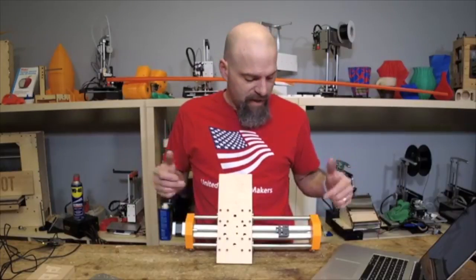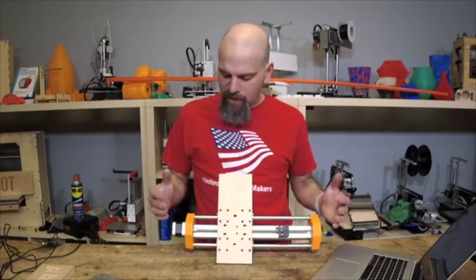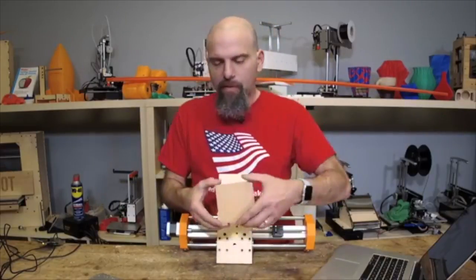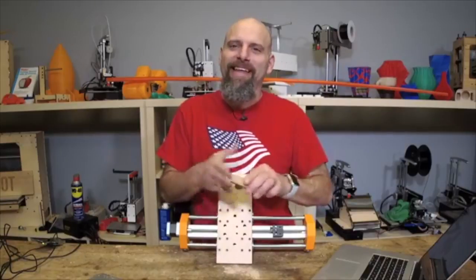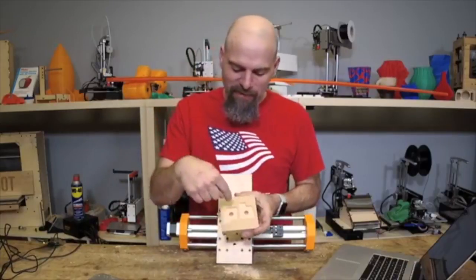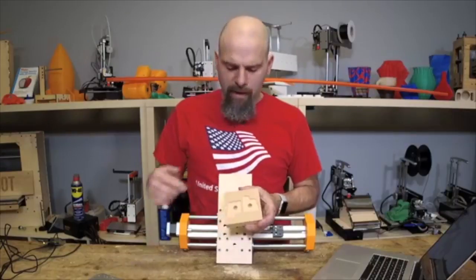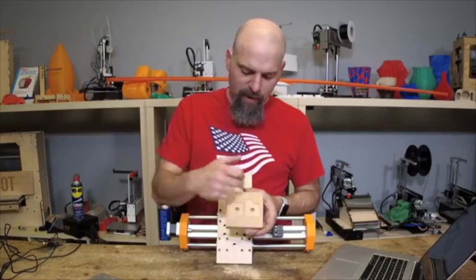Better than printed parts. And I'm designing these parts so that they can be machined easily later. Ideally, you've got one op, like, for instance, on this part, one operation. And that just means no tool changes, no flipping the work over or on its side, because, oh, we got sawdust in there. Proof that it cut today. I just got dust everywhere. Anyway, this is one op because it used a quarter inch end mill. So it can drill, and then it does flat edges. So it cut all of this out with one piece.